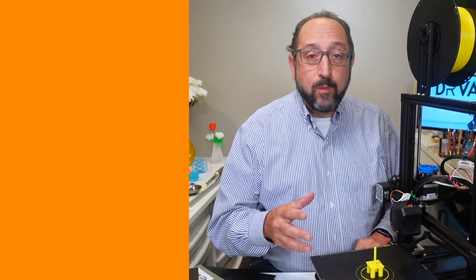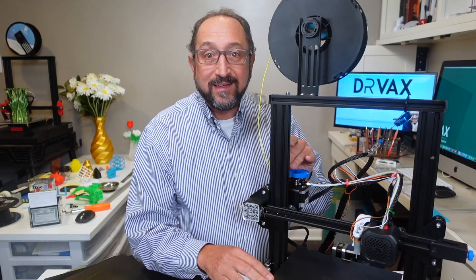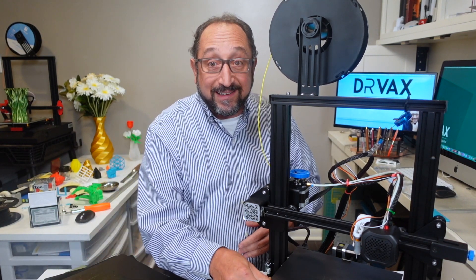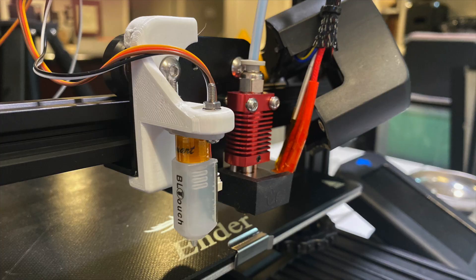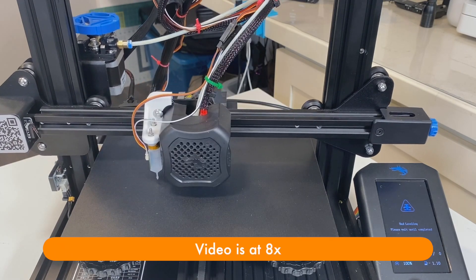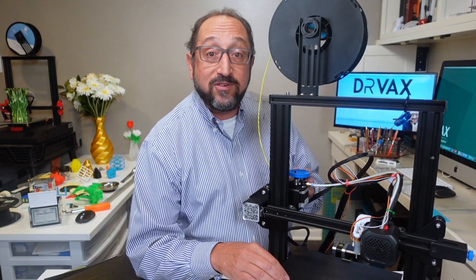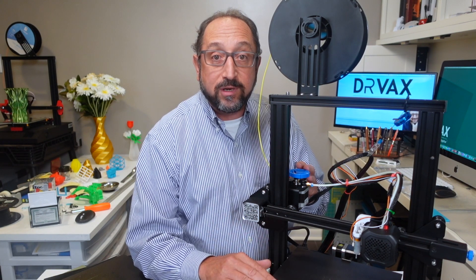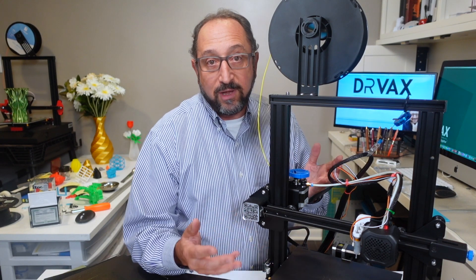I'm going to share my experiences with a range of printers. Most recently, I did a series of tests on the Ender 3 Version 2. I was able to do these tests easily — changing the build surfaces with a variety of surfaces at different thicknesses — because my Ender 3 Version 2 has been upgraded with a BL Touch. The BL Touch auto bed leveling system checks the height between the sensor, calibrated with a Z offset to the nozzle, to the build surface before each print. So I can change build surfaces of different heights because firmware uses the actual measured position to set the proper Z elevation for each layer, including the very first layer.